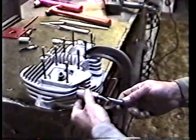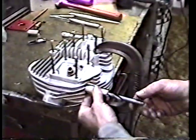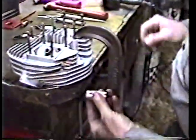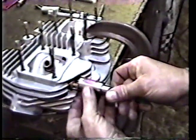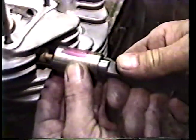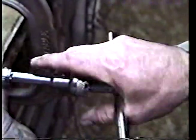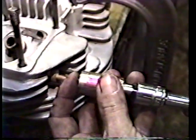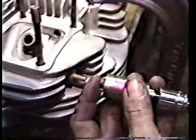After we drill this hole into the oil galley, we are ready to run the tap in there. We have another fixture that we slip in here, and we run the tap — once it comes up you can see how it fits on the fixture, nice and tight. We use a snap-on arrangement with a ratchet head to run our tap in. We use some special oil for lubrication to be sure that the threads are nice and clean, and we use the air hose to blow it out as we're doing the job, so you get a nice clean thread in there.